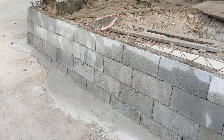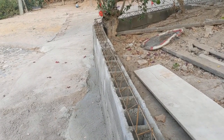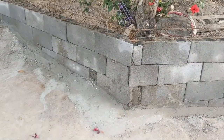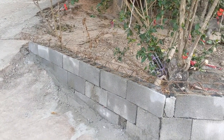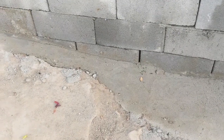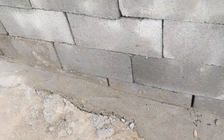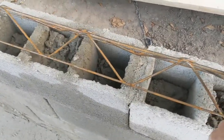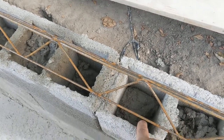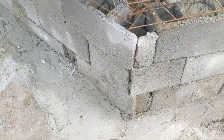We just put the blocks on top of each other, got it wet, and fill everything up with concrete. It's already getting hard. Tomorrow we just gonna put the board around it and finish it off. You can do some stucco on this side, or if you want it to look even better you can do tiles and stuff like that. The layers down there — we left gaps intentionally for water to escape through this side, so the water comes from the back and comes out, doesn't stay there. The top ones we'll fill when we put in the concrete. The blocks are deep so when we fill the top with concrete it's gonna be anchored to this wall.